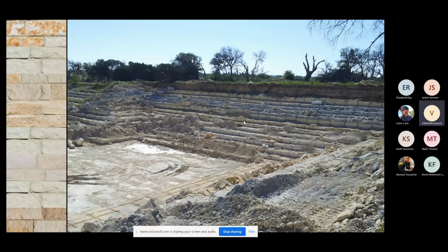At this ledge right here, this is going to be your first building stone ledge. As you see up over here in the top left corner, this is going to be our Montgomery gold. And I'm going to go over the block layout and how the sedimentary layer is set up. If you see these irony gold textures, and then, for example, this white texture here, there are 2 parts to the block. There's the bed, and then there's the seam. The mineral seam, and I'll show you a diagram of this in a minute, is where you capture your color. This is a natural surface. It will split on the seam, and it will have irony and mineral deposits that give it its colorful characteristic.